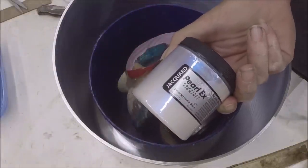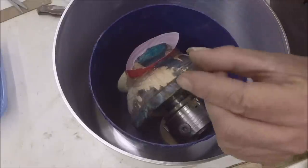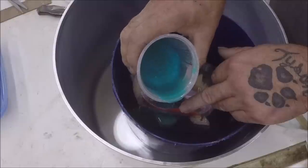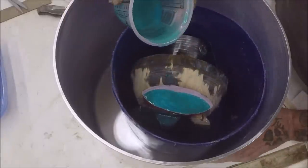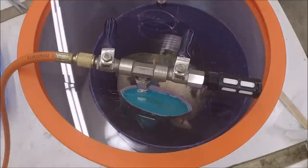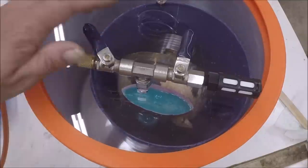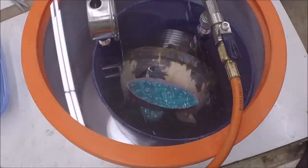I switched out the resin — I didn't use the thick set, I used the two-to-one epoxy. That shouldn't be there, and it's irritating me because this is really pretty and that's really ugly. So let's see if I can fix that. I'll pour a little bit of Mermaid and some interference blue down in there. I don't know how far these cracks go, but I only need this to go in far enough so I can turn the inside and have solid. Sit this on the vacuum chamber — look at that, it's bubbling!